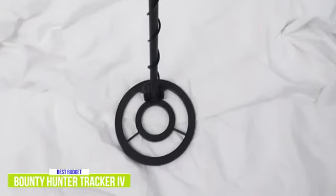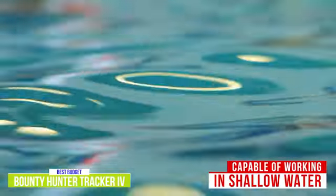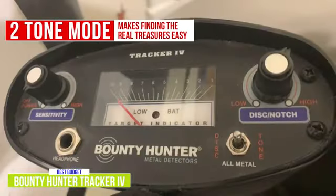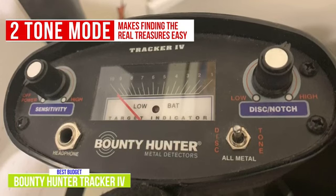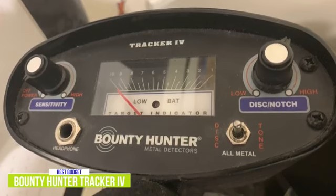This coil is capable of working when completely submerged, but only in shallow water, so looking for objects along beach shores is perfect. Coin-sized targets can be detected at depths of about 6 inches, while larger targets can be detected up to 2 feet deep. The two-tone mode allows you to bypass many of the uninspiring metal finds so that you can focus on the real treasures out there. Making best use of this feature is done with headphones so that you can really focus on what the detector is pointing out. A quarter-inch headphone jack is present on the main interface, so getting set up is quick and easy.